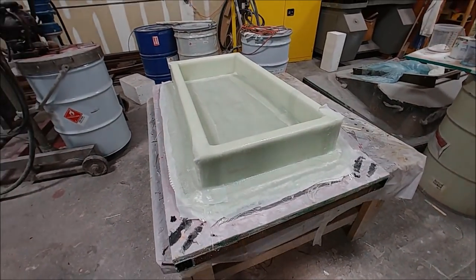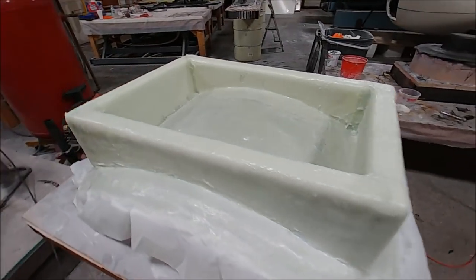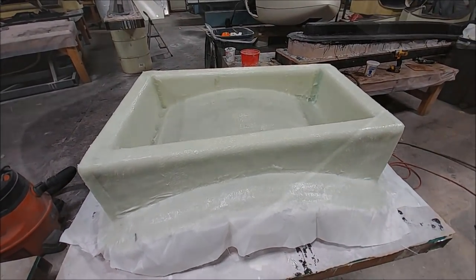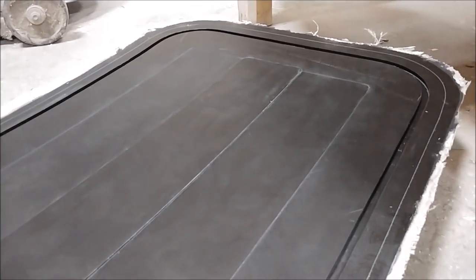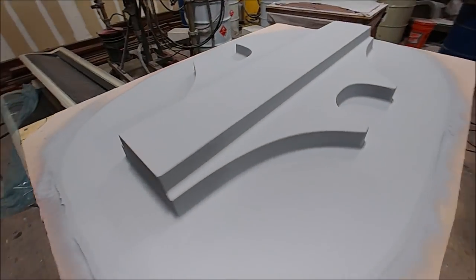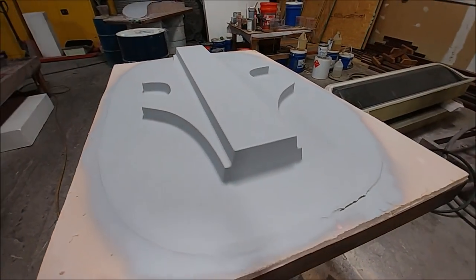They've also been putting the bracing on the last couple of molds they did — that was the one for the nose gear doors, and this was the one for the little parachute cover hatch. They just need to be trimmed around the edges. Here's the one for the nose gear door — that's been released, marked, and ready to be trimmed off. And here you can see the one for the rear seat mounts already has the first round of primer on it, so moving along fairly quickly.